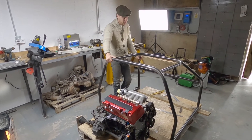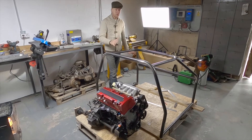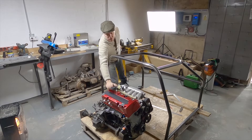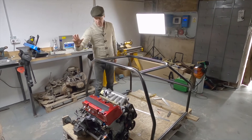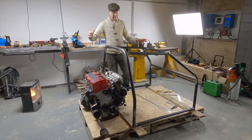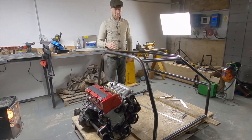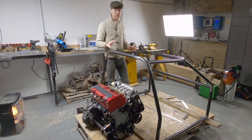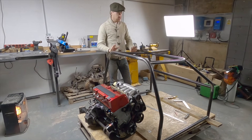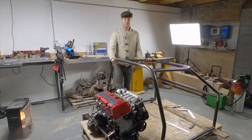I've chopped my legs down on the roll cage, and the reason I've done that is at this stage I need to make sure all my dimensions are correct so I don't end up with big problems further down the road — and fortunately they are. I've also moved the engine off the blue pallet on wheels and put it on the chassis table. My reason for doing that is I want to put this next back bar in and the blue pallet was getting in the way, and all my levels were a bit off. So I'm trying to level things up as they're actually going to be. I've checked all my angles — they're correct, the angle of the bottom door bar is correct, and the angle of the roof is correct.